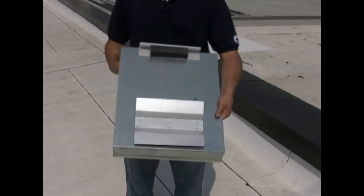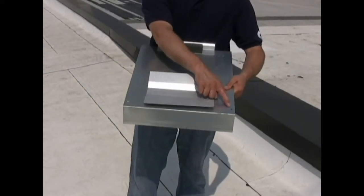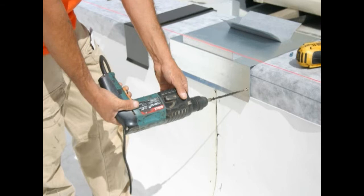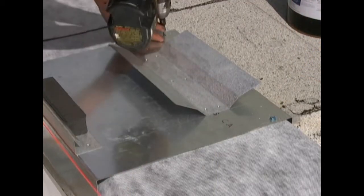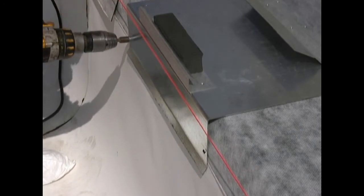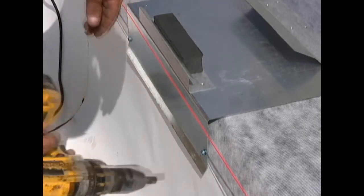As in all cases, be aware of the pre-punched holes in the anchor chairs. These holes provide guidance for the fastener locations and pilot holes for pre-drilling of masonry or concrete, either poured or precast. To be ANSI SPRI ES1 compliant, anchor chairs must be fastened according to the coping test approval. The pre-punched holes in the anchor chairs are located according to that ES1 approval, and fasteners must be installed at these locations to be compliant.